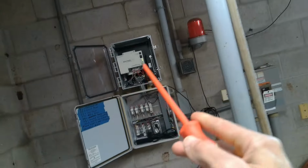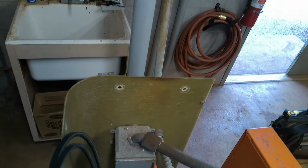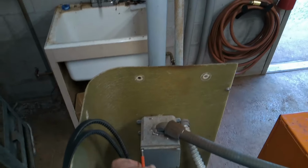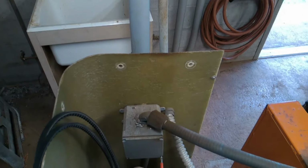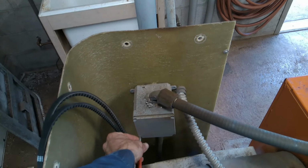Because the first thing I want to check is what that green and white wire is doing, because if those touch, we should get an alarm call out. And before I bother with the Sentinel, I just want to verify that everything's how it's wired. Maybe it's never even been wired correctly. So can't assume anything. Let's see.